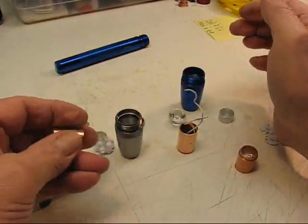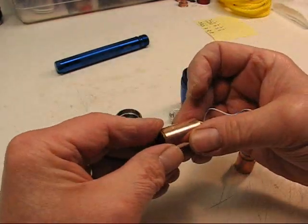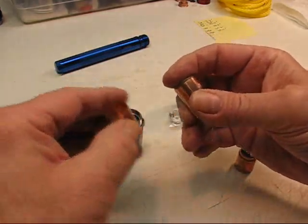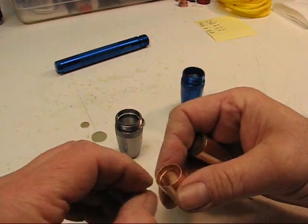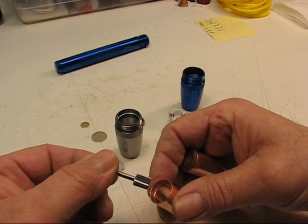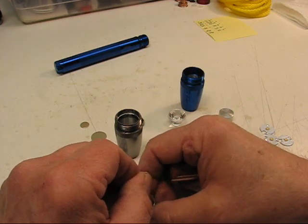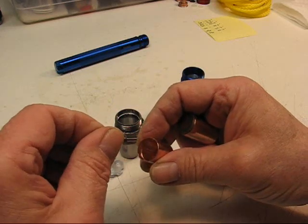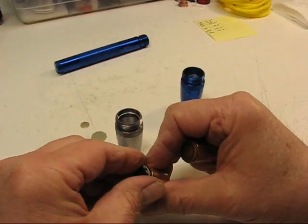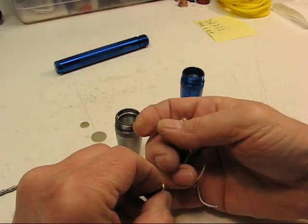I'm doing a couple different ones — they both basically work the same. I'm doing a triple here, and then this one is the single that I'll be doing most of the time. On the single, I'm using a 1.4 amp driver, and what I've done is I've cut away in the bottom of the copper coupling to make a shelf. So I've opened it up, and I've used just a 115 drill cutter in the drill press and do the same thing — just hold the coupling and turn it while the cutter is rotating. That way the driver — this one is a 2.8 amp driver, and it's got a couple extra chips on it, so it'll be over 3 amps — but it'll fit inside that coupling now.